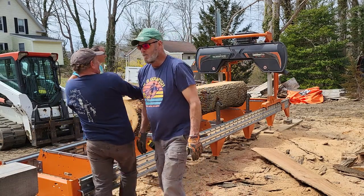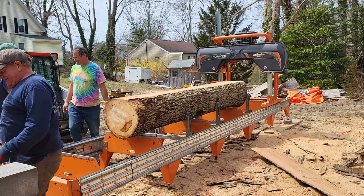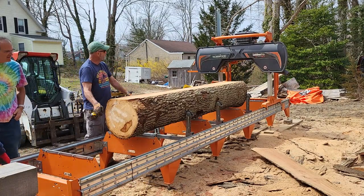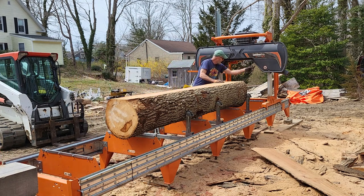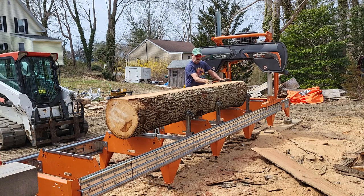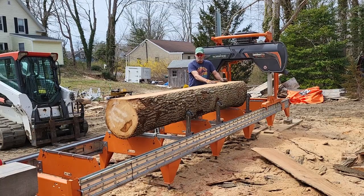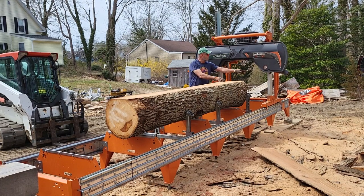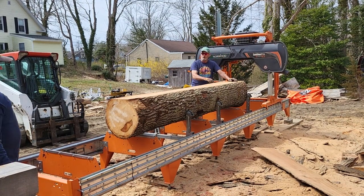So you're getting spoiled for this thing. I remember you holding that monster chainsaw. Oh, no. This is a nice setup. I just did a whole changeover, changed my blade guide system to the roller guides. I've been testing them out, and it's just such a world of difference. It cuts so much better with those than it did with the old ceramic guides. So that's pretty much what the videos are about now, running these new roller guides through the ringer here and seeing how they work.